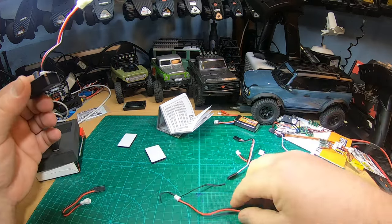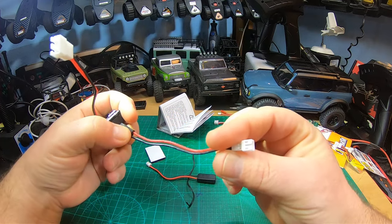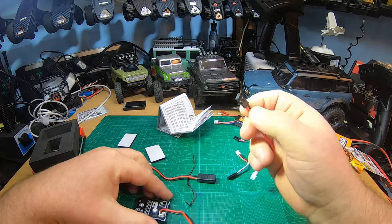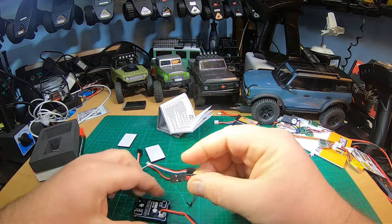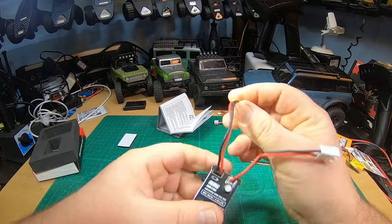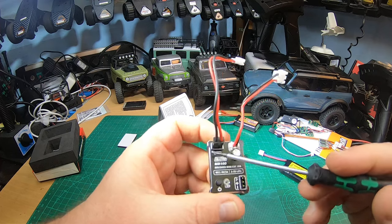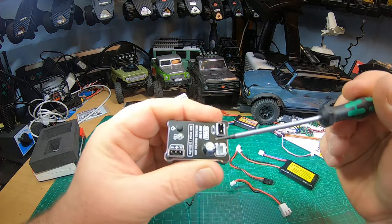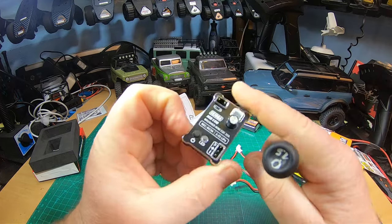There is also a motor plug — JST PH 2-pin — as many motors in micro trucks like the SCX24 have. There is also a quite special servo plug here that looks like a DuPont plug but with a larger distance between the pins, so not the most elegant choice. What is a bit strange: the plugs are not labeled — only plus and minus — so there's no motor or battery labeling. If you only have the ESC and don't have the plugs attached, you wouldn't know where to connect the battery versus the motor. That's really a bit strange, though it is of course described in the manual.